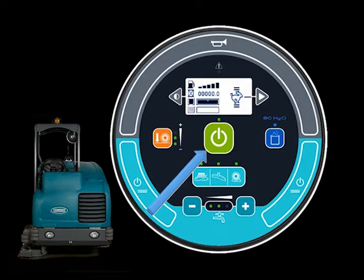The large green button in the center of the control module is the one-step button. Pressing this button turns on all cleaning systems that are set to standby. Note: there may be a short delay before all cleaning systems are activated and the indicator light turns on. Pressing the button again turns off all cleaning systems. When the one-step button is pressed to stop cleaning, the machine remembers which scrub settings were active, and when pressed to start cleaning again, the machine will return to those settings.